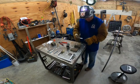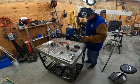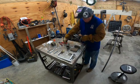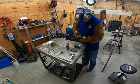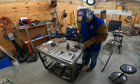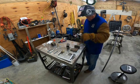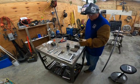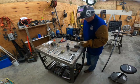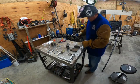Take this little cross bar I'm going to put on the top of this nut. I've ground that nut down on the top, a couple things to get rid of the ridges on it, that comes on the top of these bolts. And so I took the head of the bolt and ground all that down. And then I had a piece of rod, and I've ground the coating, the galvanization, off of it, and you can tell when it comes off, it stinks. I also put some in acid the other night, took a muriatic acid 1 to 4 concentration, and set it in there for a couple hours, and came back, and the odor was awful. So I knew it had taken all that out.